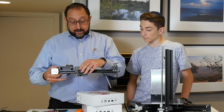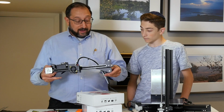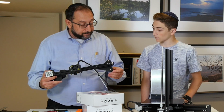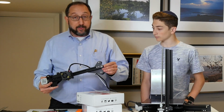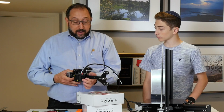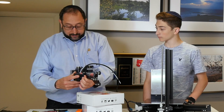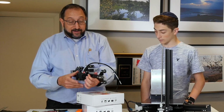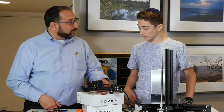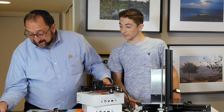Then you can put on the hot end next. Then you put on the Z-axis support wheels. Finally, you put on the idler on the other end. You need to pull that a little bit tight. You should be able to move this, but there should be a little bit of tension. So that feels like it's nicely done now. Okay, Zach, we only redid 2 things, I think. That wasn't too bad. Okay, let's see what's next.